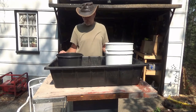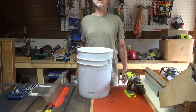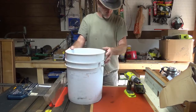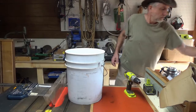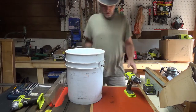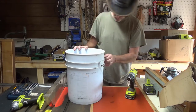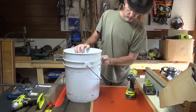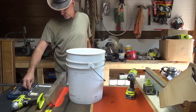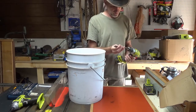It's going to be a larger project, because first I have to prepare the tanks. Now the first part, I cut my head off. The first part, and the easiest, is to put some holes in this bucket here. What I want is the water to fill up to a certain point and pour out. Actually, this is the strongest point here, this lip. That's a strong point in the bucket, so I'm going to go through it here with a 3/4 inch bit. Should work just fine.